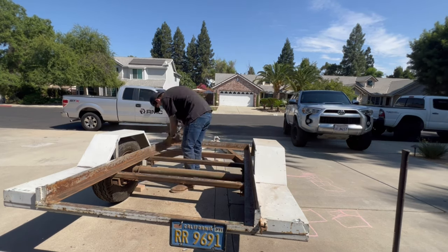I'm just gonna stitch it on the backside, front side, and that way when that plate lays, I'll just butt it up to here, and then I'll stitch weld the plate to the back and along the edges. Depending if I get any flex from it just being stitched on top, I might go through and put a couple on the bottom. We'll find out. I'm gonna have quite a bit of weight on here, so I'm pretty confident the plate will be just fine stitched around the edges, but we'll see.